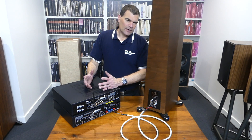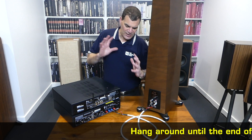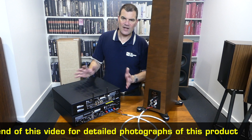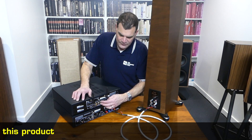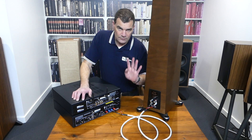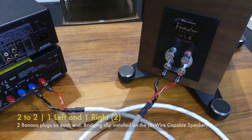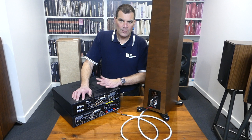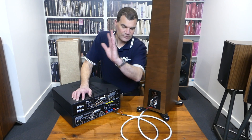Conceptually, looking at it as the master associated with two power amplifiers driving the speakers. We're going to start with a very simple configuration, which would see the pre-out of this going straight into the pre-in of the amplifier. Because we're just focusing on one channel, we've got a traditional two-to-two configuration from the amplifier into the speakers. That's a very traditional pre-power combination — obviously the other channel goes off to the other speaker.